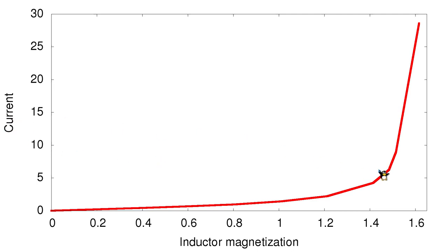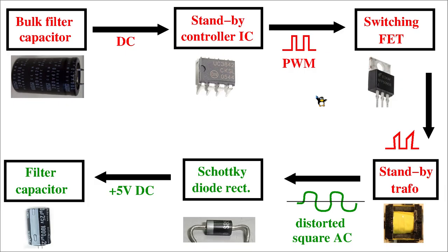Right after reaching magnetic saturation, the electric current flowing through the circuit goes radically out of the normal range for a semiconductor. For example, if a field effect transistor is turning on current through an inductor and we reach magnetic saturation, we would burn out that transistor. In a switch mode power supply, we use a field effect transistor to provide current through an inductor, so to avoid magnetic saturation — which would blow up the FET — we must provide a pulse width modulated signal causing the transistor to turn on and off very quickly.